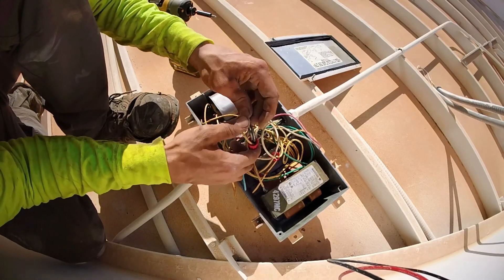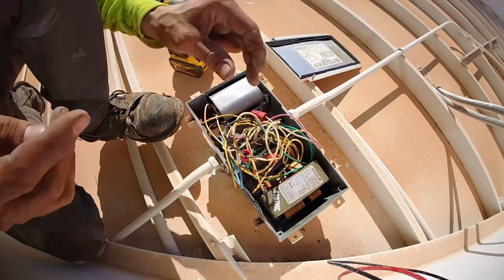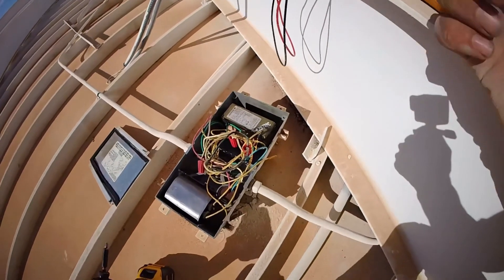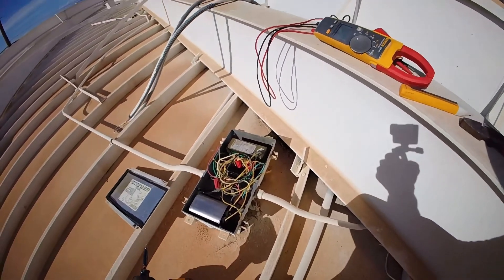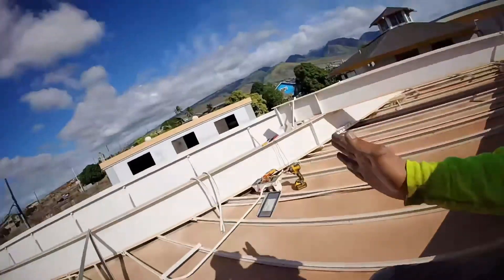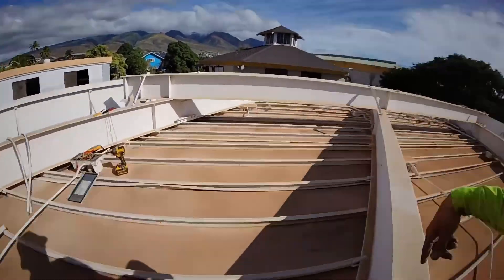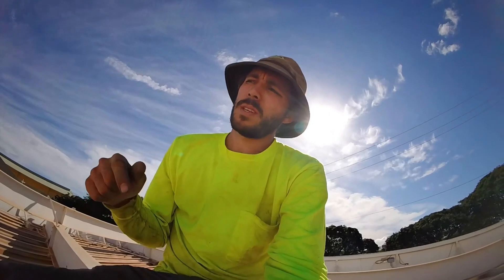You can hear the crustiness of the wire — it's just old wire. I can see the metal of the wire nut in there, so that should be good enough to check voltage. Lights back on — you can still hear that noise, which is pretty sketchy. I put my leads in with the circuit off and then had them turn it back on to verify voltage. There is voltage on this string, and there is on that string — so it all points to the bulbs.